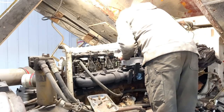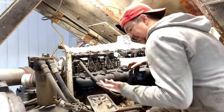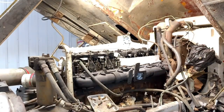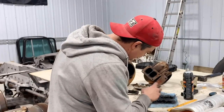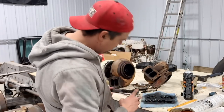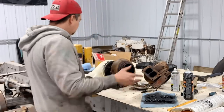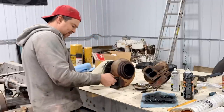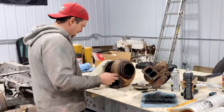Keeping dirt from falling in the engine. I'll clean my fingers for these nice white covers — can't have those nice covers and use old rusty bolts, so I'm giving them a quick coat of paint. While we let those dry, I'll flip over to the turbo. I still need to get these studs out, so I'm probably going to zip cut them and then use the air hammer to pound them out the back way.